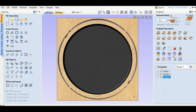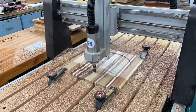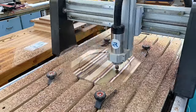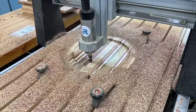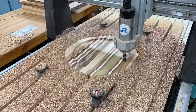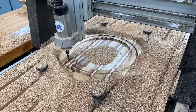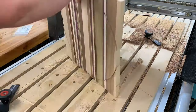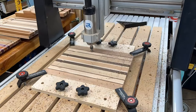That's how you make the circle tray with the recessed surface — essentially a glorified dish or big juice groove. Now for the actual carving on the beautiful hardwoods — it's pretty mesmerizing as it goes around, almost hypnotic. It makes quick work. You could use dust collection. Now it's getting super smooth thanks to the changed step-over percentage for that final pass. Then switching to an end mill to cut the profile and get that dish shape out.